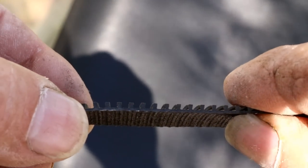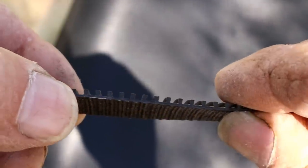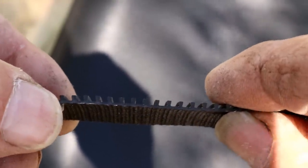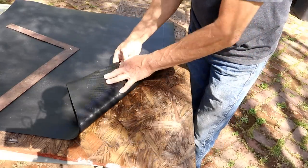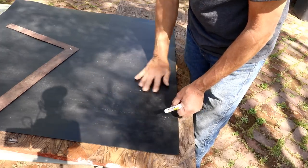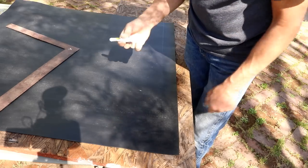The first thing we want to do is figure out how wide to cut our matting. I like a good square-ribbed matting — I'll give you a close-up. This is a sharp square-ribbed matting. Preferably you want a nice thin matting, not real thick — the thinner the better so it's more flexible. The first thing we've got to do is square the edge of our matting, making sure the edge is square to our ribs, because when they cut it at the store it won't be square. When working on the matting, I work with the ribs down on the back side.